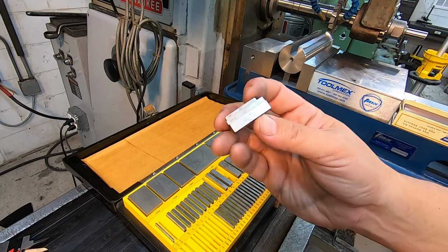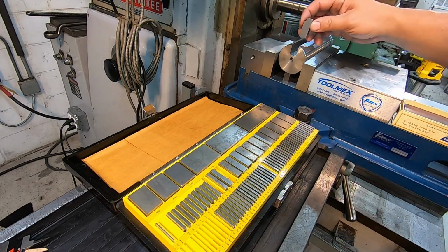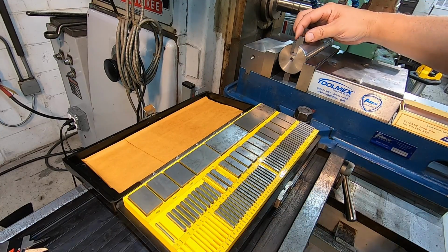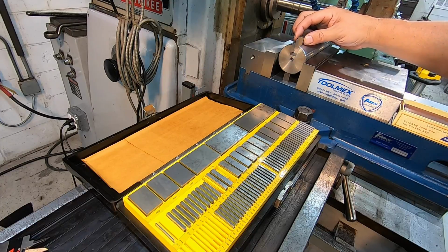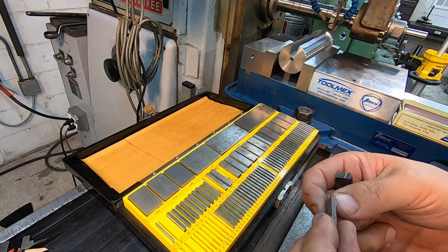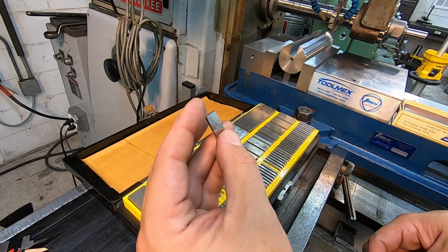So anyway, we got a 562 gauge block stack up right there. You can see we got them rung together, and trying them in the slot here, it actually fits in there. I can tell that it's slightly over that, so I need to go to, let's take the 112 off here. This is a 112 gauge block. I'm going to go to a 113 gauge block right here.